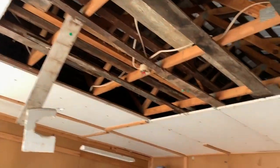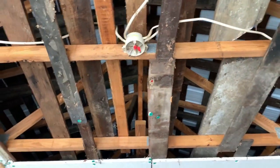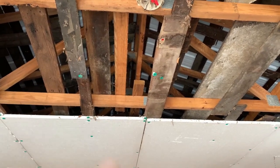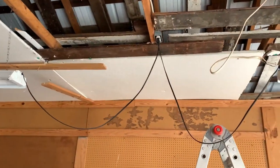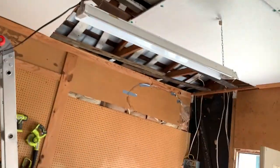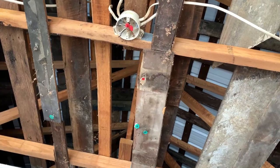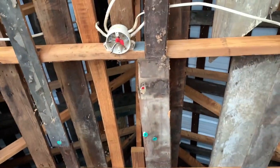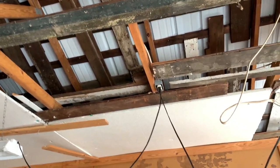So I took down the ceiling fan and disconnected everything here from it. It was working, power to here just fine. I tied it in with that outlet and whatever that stuff is over there, and it tripped. So I went over to that outlet, disconnected everything, disconnected it from the switch, disconnected it from this circuit. So now we just have a home run shot coming into here, a junction box connected there with those two wire nuts, as you can see, going over to my outlet. Just for now, just to test it out to figure out where the problem is.